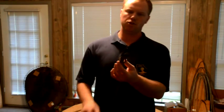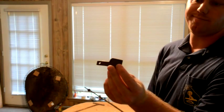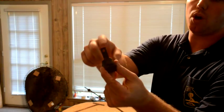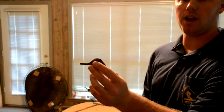I've got these drowning locks. That's just a 1 inch square tube cut into an inch and a half section, and then a piece of angle welded on the side with a hole drilled in that allows it to go down the rod but not come back up to lock in place.